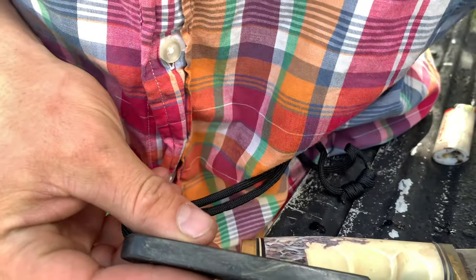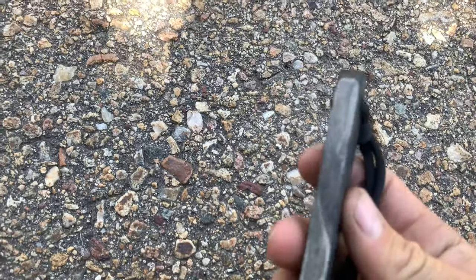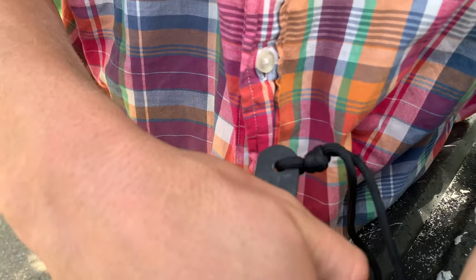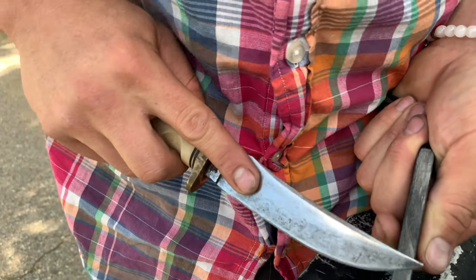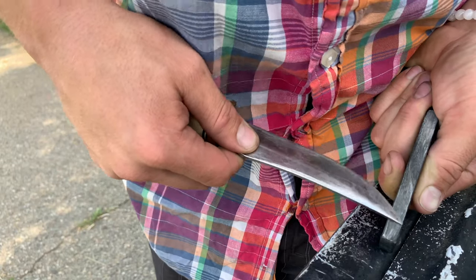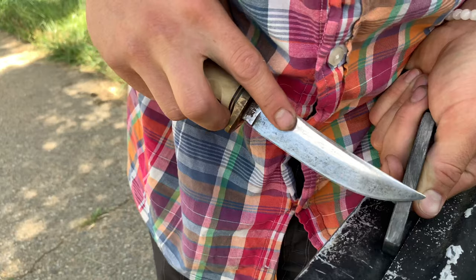Another thing you can do with one of these stones — just to really show you how tough this material is — is prep it with some concrete. I'm doing this on the side because I like to use the side like a metal file. That's not as good a technique for the surfaces of the stone, because you want a more uniform scratch pattern for your sharpening surfaces. Back to a little more filing at the tip. You can count how many circles you do on each side, but sometimes one side needs a little more than the other — really, it's a feel. Don't do a hundred on one side without at least checking and comparing before you do another hundred.